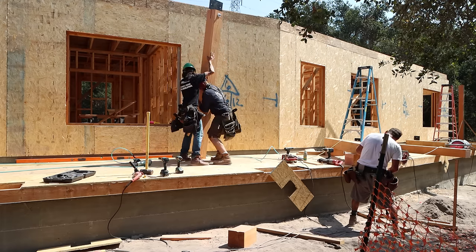We kind of bounced around. We got our ridge beam set. We got our beam set for our rafters to land on at the bottom there. We got all of our posts in the back elevation marked, taken down, cut, knife plated, and put back up in place and finalized. That's all complete now as well. At this point, we are ready to drop all of our beams in there, which is what Greg worked on the better half of the afternoon.